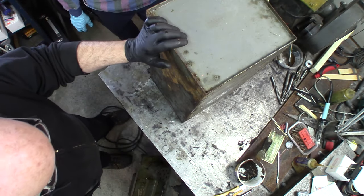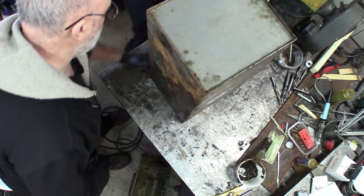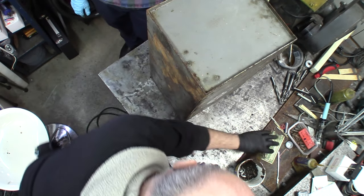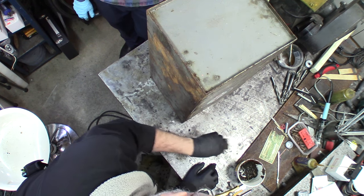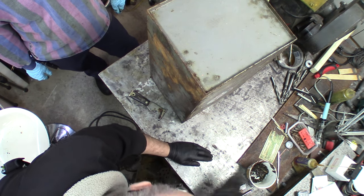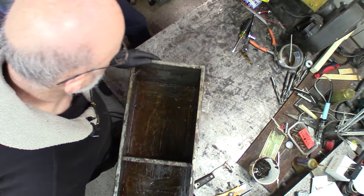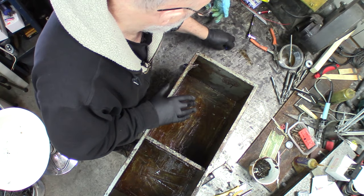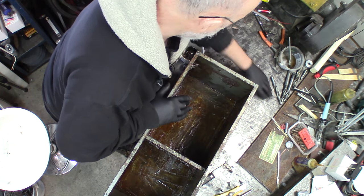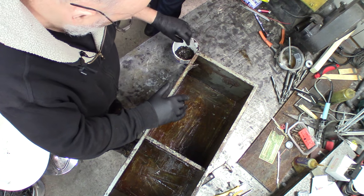When you use the good stuff for coolant and keep it at the right pH or concentration, you get the anti-corrosion. The guy who rebuilt it said the synthetic coolant is pretty bad for corroding, and suggested using water-soluble oil instead. I'm using the water-soluble oil, it's been my practice. If you're in a business, the coolant gets used up before it goes bad. But you can replenish it up to a certain time. You have to get a refractometer to control its state, then you can make it last much longer.